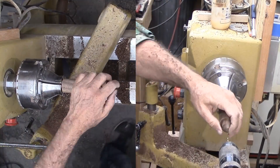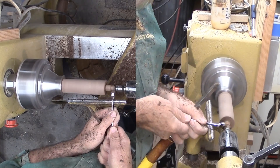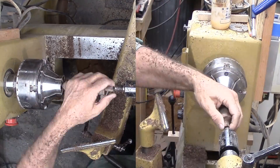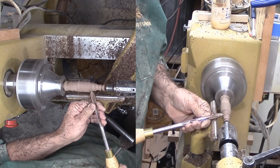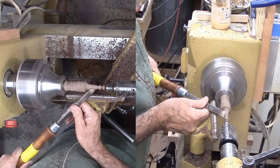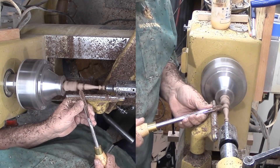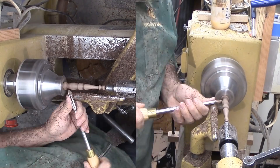With the longer section of walnut again mounted to the chuck, I realized I did not start the shaping. Oh well, I'm cutting a new tenon on the walnut. Now that the finial is reversed and mounted by its base, I can better visualize its shape. When turning a finial, it is not always to the right — I know it could be flipped but this is easier for me. I've turned the lathe speed up close to maximum and gradually work down the finial until it looks good to me. It was a bit chunky to start with. For ornaments, I don't want them extremely thin because children will likely handle them. Plus, I always put a blunt end for the tip. Then sand and finish the finial with friction polish.